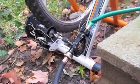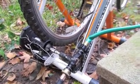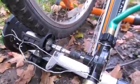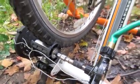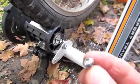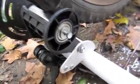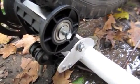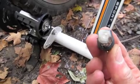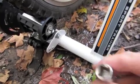This is a basic drill pump that's hooked up to one of these trainer frames. With a couple of parts that were adapted for the use here, we were able to create a bicycle pump. I replaced a machine screw with a rounded head with one that has a hex head — it's a five millimeter thread. With a grinder, I had to square off the end so that that piece would fit into a ratchet adapter.